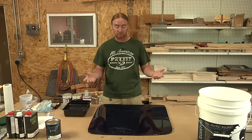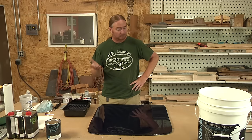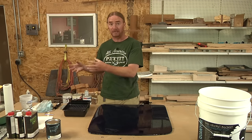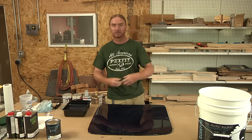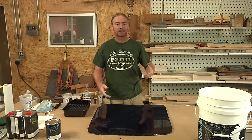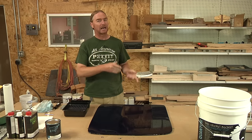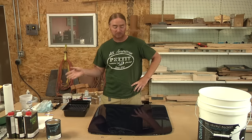That's not the end of the world that I missed that, because there is a fair amount of dust in here. I'd cleaned everything off pretty well, so I'm wondering if there's just some lint or dust trapped inside the rollers, and as you're rolling the paint out, whatever's on there is just flowing off and into the paint. Just a guess, because that's typically — relating this to varnish — nine times out of ten the specs you get on a piece are flowing off of the brush, not necessarily airborne particles.